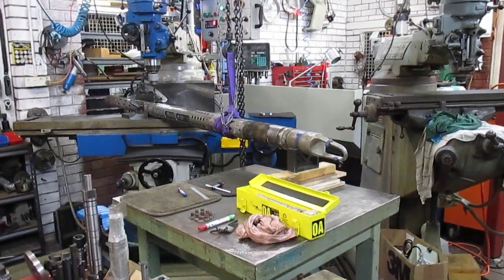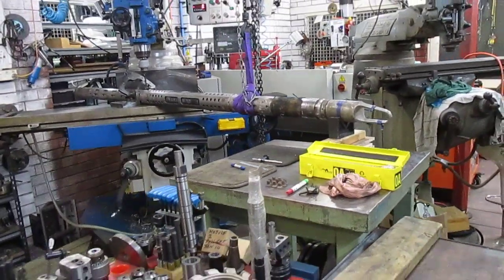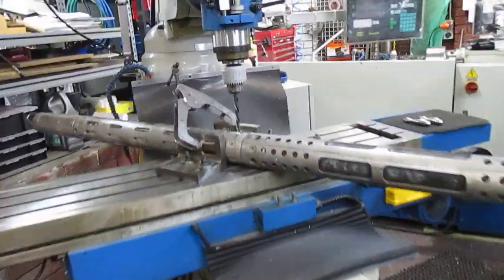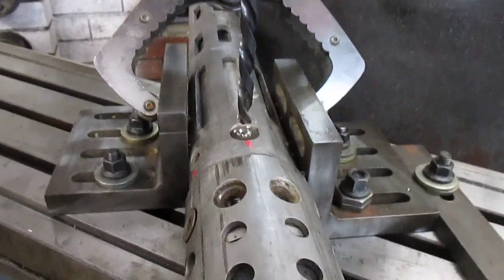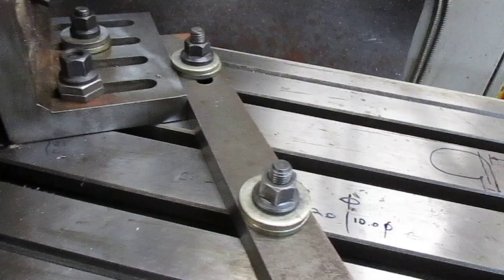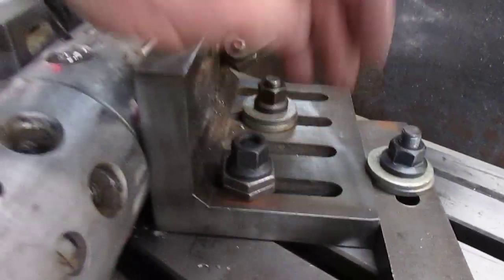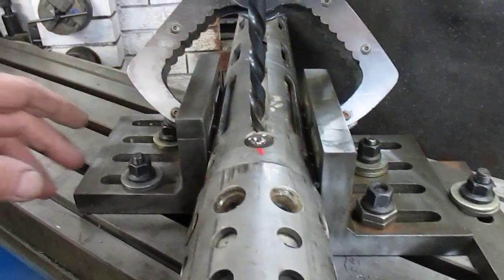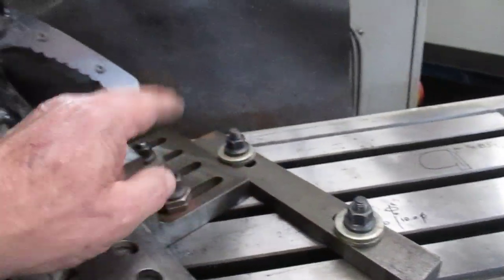I've now set up the tool, as we call it, on the mill and supported on the mark-out table, and I'll show you the method I've used for setting in place for doing the drilling. I've taken two angle plates and set them up just to hold the cheeks and position the tool. Behind that I've put a parallel to support and hold the line of this back angle plate, which I'm using as a sliding jaw. I back these off fractionally and clamp them up as I turn each one, and this parallel here is just to not lose direction.